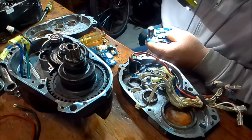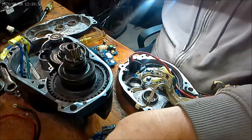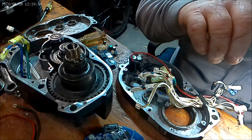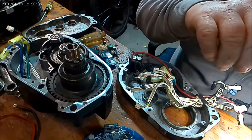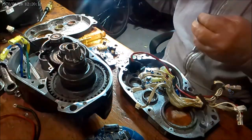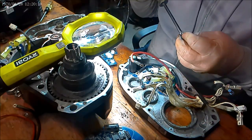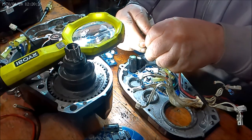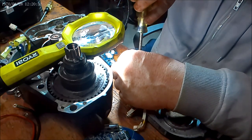I don't see anything special about the different screws. I see the standoffs for the other screws. It's got to be these ones — they have a standoff on them. Maybe I messed up my controller by not paying attention to the screws I used, because this screw has a plastic insulator standoff on it.